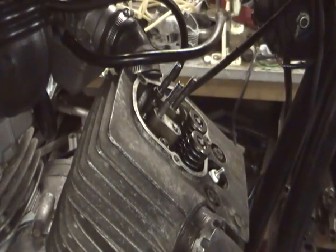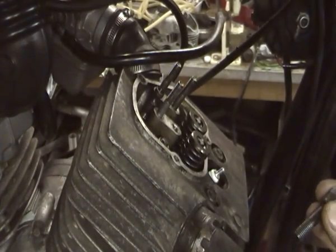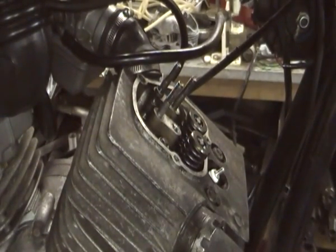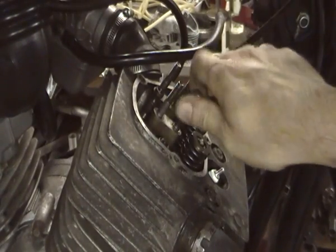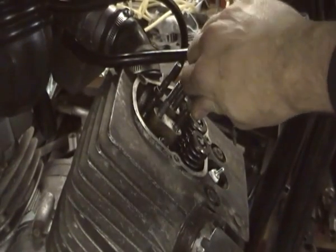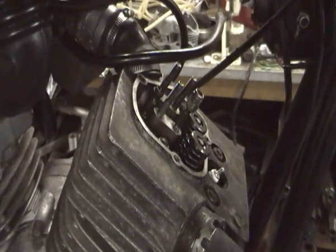Then the stud can be screwed back in, and I'll put a little Loctite on that because originally these would have been tapped with an undersized tap to make it an interference fit, so that the stud would stay in the head when you unscrewed the retaining nuts. But this is a standard tolerance thread, so as you can see it's going to screw in with little resistance and would unscrew every time you try to remove the nut. So a little Loctite will sort that out, and job's a good 'un — it's all ready for the valve gear to go back on when it's been re-bushed and new shafts put on. And that's all for now.